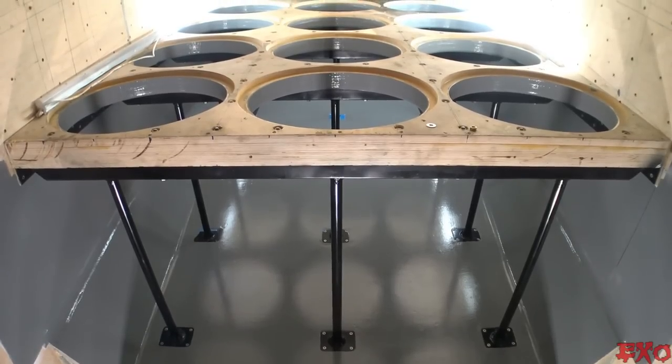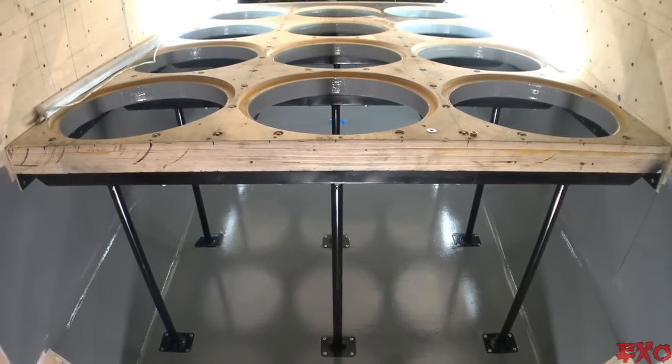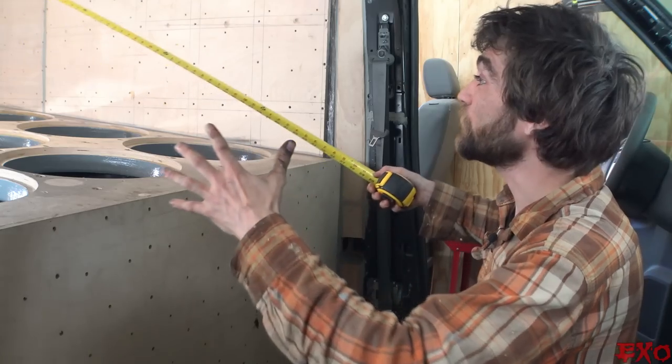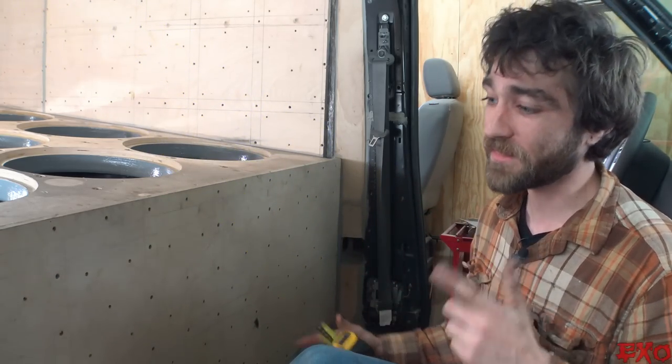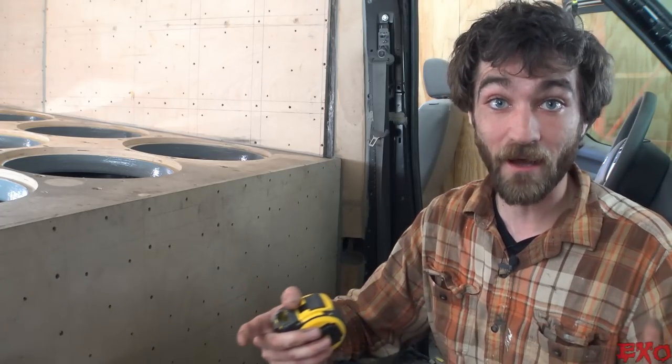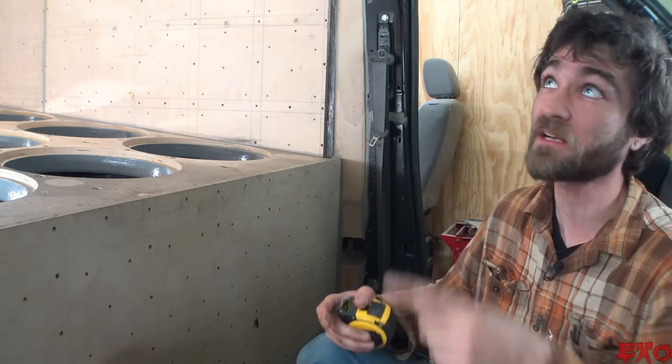We are making ports today. That's right, 12-18s, baby. Gotta whip up a little something for the bottom ported chamber of our bandpass. It's gonna be a huge 57-inch port, width-wise, and I'm thinking interchangeable. Why not, right? When fine-tuning comes, it's super handy being able to swap out different ports to find that sweet spot, especially after the cabin plays an influence on things.